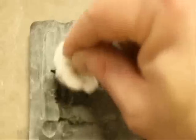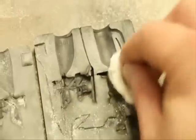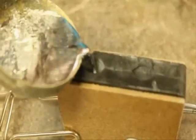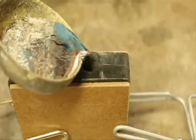Focus putting the talcum powder on edges of the mold surface rather than concentrate it on the figures. Excess talcum can block vents. The grains are to allow the air to escape between the rubber. Clap the molds together to shake out excess powder. Apply the rough side of the support boards against the molds. The grain will allow the vent hole to let air escape, as well as improve grip against the rubber surface.